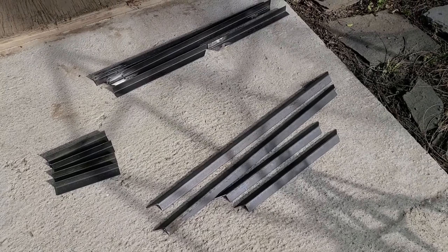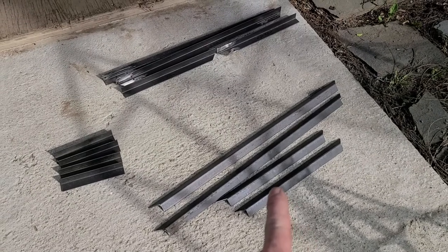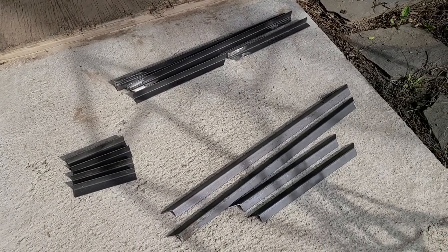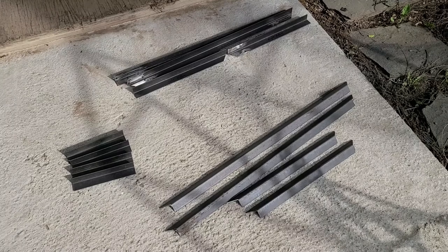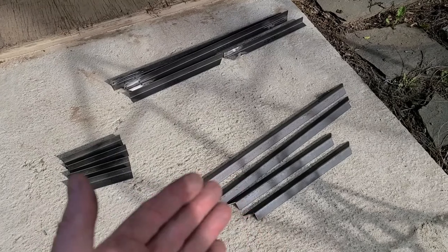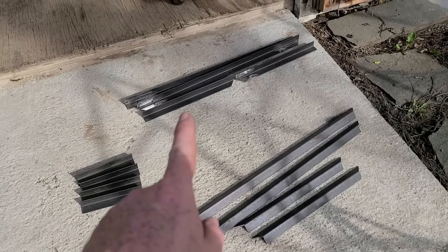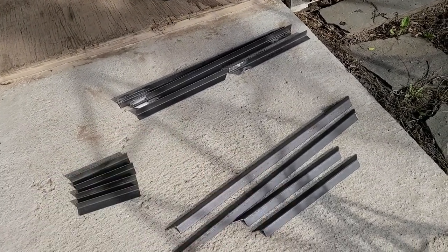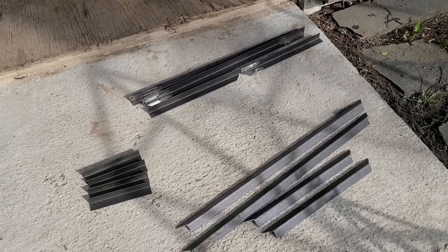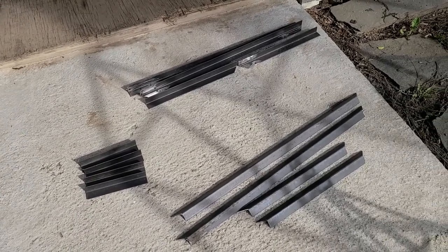Okay, it's time to make the frame for around the toolbox. Got my pieces cut, but had to hopefully get my angles right. Even though it's a simple box, the bottom is going to have the angle iron cupping in supporting it, and the top is going to be flared out like an edge, like the top of the trailer is. And I just got some support legs about 8 inches. So let's get that welded up quick.